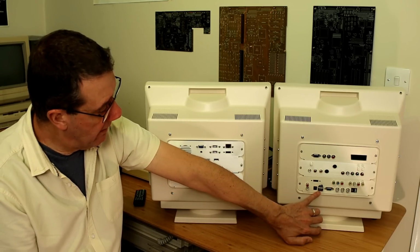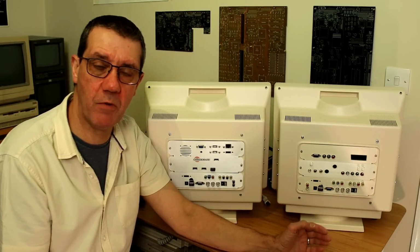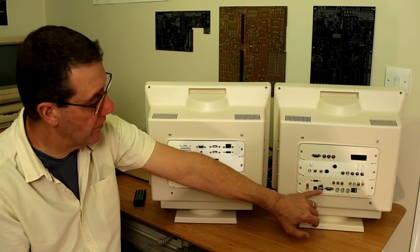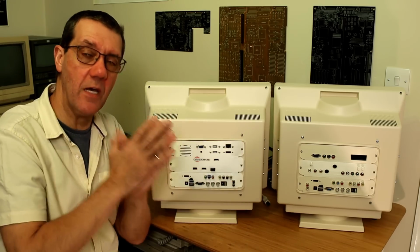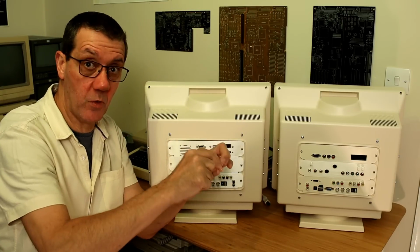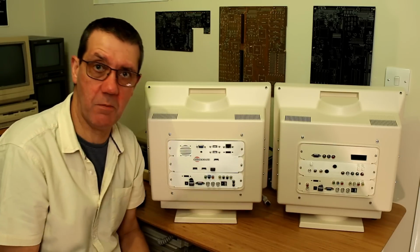Next we have the HDMI. Now you'll notice, because we haven't got the breakout boards yet, what the breakout boards will do is internal connections. So for the prototypes, I have these little connectors with ribbon cable that goes inside and does it correctly, so you get neat signals. But ultimately the internal will have a small connector that goes to the bridge board, and there'll be an internal HDMI connector.